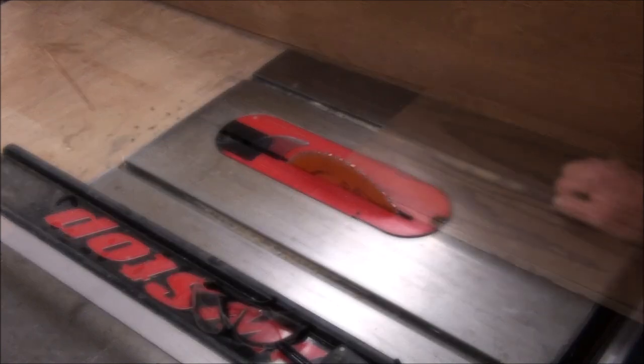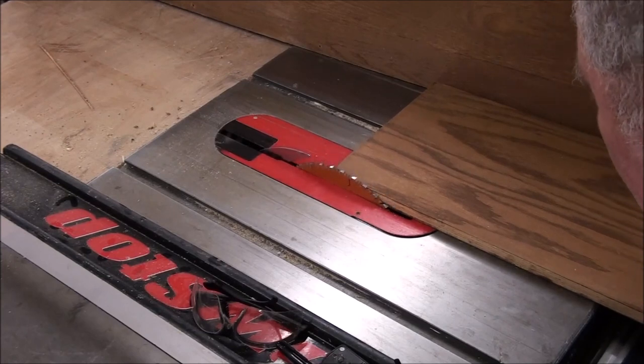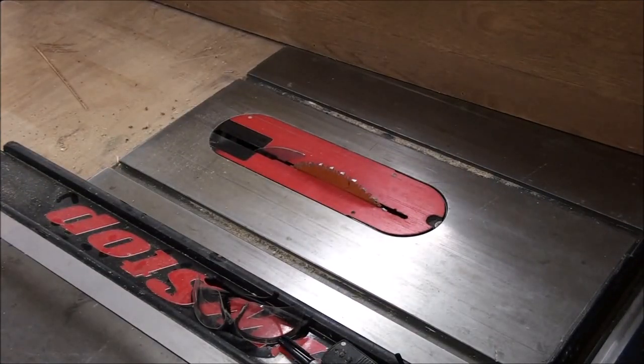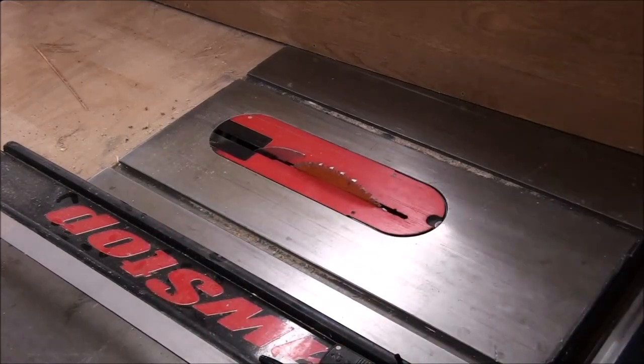It's a huge blessing. I'm gonna run my blade depth not very high, just above the material, half an inch or so. Okay. SawStop has a safety switch, so I have to turn the master on and wait for the brake cartridge to initialize. I think what it's doing is it's charging a giant capacitor in there. And it's ready. Safety glasses.